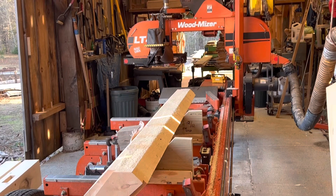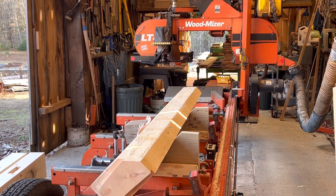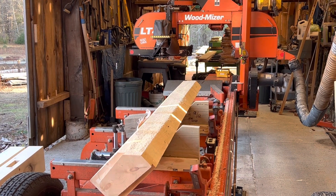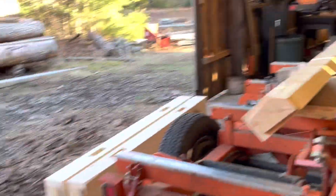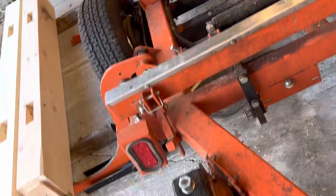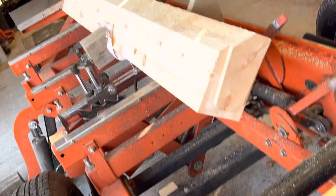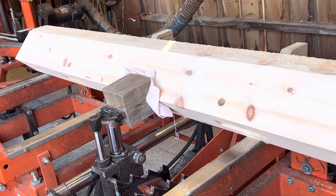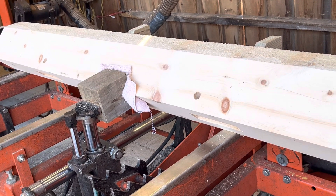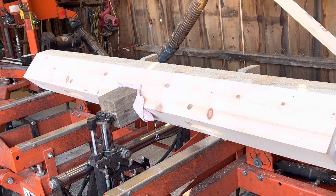So this is the idea: if you've got a sawmill, or a friend with a sawmill, you can make up some jigs and cut your ridge poles pretty much to a perfect angle with a couple jigs, slow and easy. Let me swing around the back side — you'll see how I clamped it up. I've got a clamp that matches the angle, and a rag so I don't put a ding or dent in the timber, because it's pretty much finished other than this ridge pole.